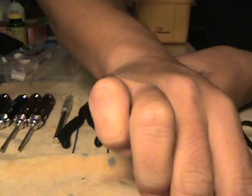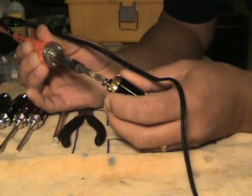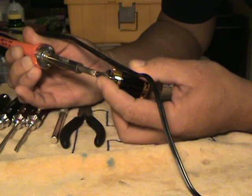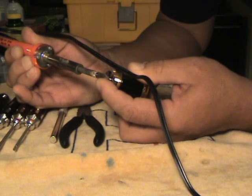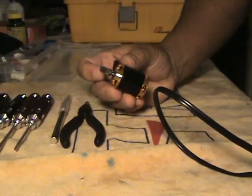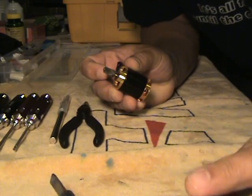In order to break that thread lock bond, I use heat — just my regular soldering iron. I apply it to the tip of the motor shaft, and at the same time I put my finger on the pinion so I can feel how much heat is being transferred. It will not take long. Right there, it's pretty darn hot — in fact I can't hold my finger on it anymore. I figure that's hot enough to break the bond from the thread lock, so I'll unplug the iron. Don't forget to do that — get it out of the way so you don't burn yourself.